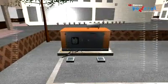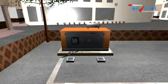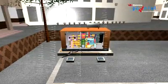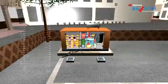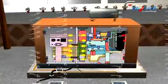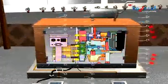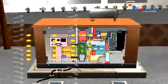While placing the genset on the foundation, consider natural wind flow and place the genset in such a way that the natural wind flow and the generator fan wind throw direction are the same. Fresh air from the alternator side enters inside the canopy and hot air is blown out by the pusher fan from the radiator side.